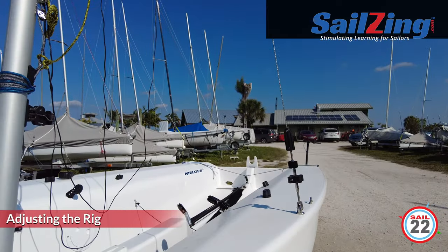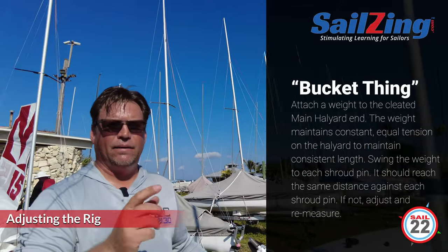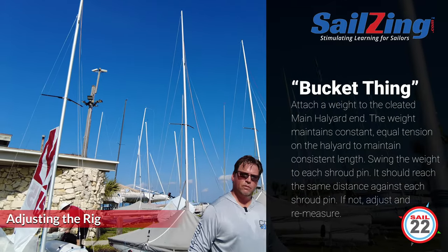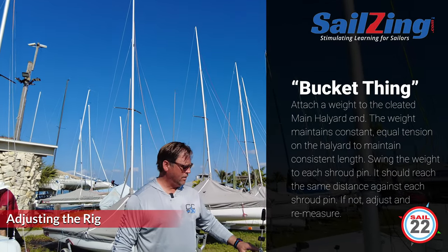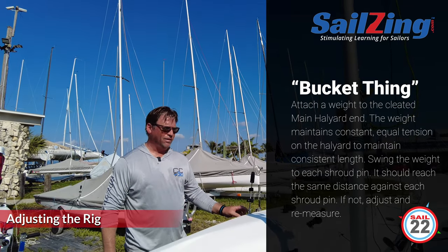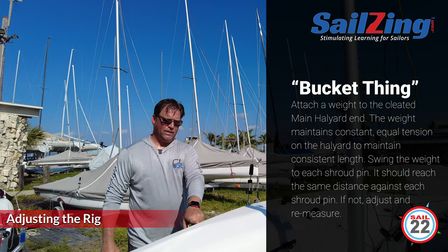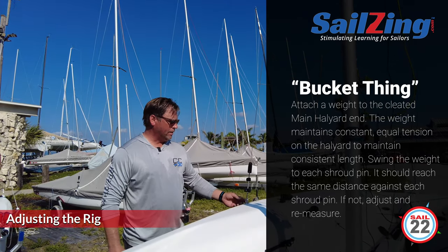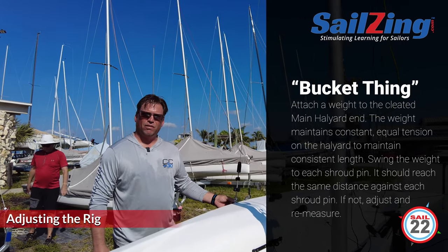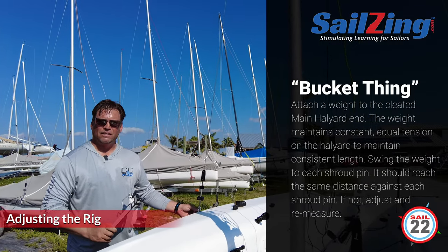So that's why you want to do the bucket thing no matter what. If you put weight on a halyard, it stays the same both sides. You switch it both sides. I mark to an actual fixed piece. So I would go to the pin, because the boat, you know, they could have sanded a little extra here or something. Yeah. Some people will take a tape measure and make a mark up here as well. I don't think we need to with these, but if you go to the pin or say the bottom of the pin, and that's where your measurement is, and the measurement doesn't need to be numbers. It could just be a mark on a piece of tape on the bucket that both sides then are the same. And sometimes that's even easier.